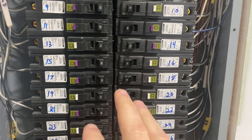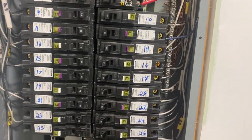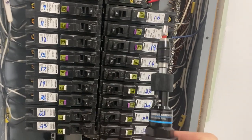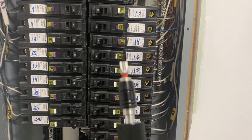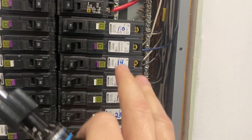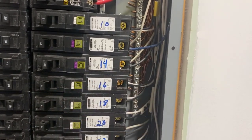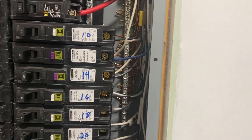Going over all 21 breakers: I had four breakers where I turned significantly — more than a quarter turn — to get them to 36 inch-pounds, and maybe two more that needed just a very slight tightening before the torque wrench indicated 36 inch-pounds. It brings me comfort knowing that my wires now have the right clamping pressure according to the manufacturer who knows best. And maybe a loose connection is exactly what caused that wire to melt and caused me to have to change it out.